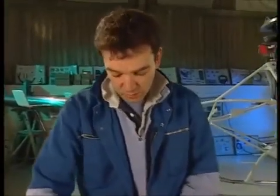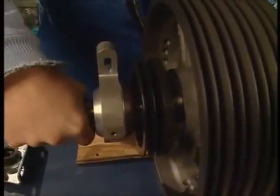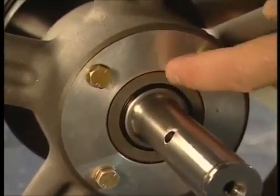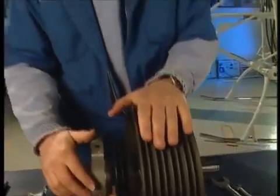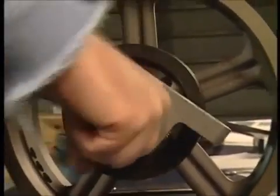Basically, back to your old bike — it's a freewheeling hub, which means the shaft here can turn that way but it can't turn that way. And the reason this is so important, and this is where your sprag clutch is — inside here — is if the engine fails and it stops, this part of the drive will stop turning. But it means that the rotor blades can still turn, which means that you can auto-rotate to get to the ground.